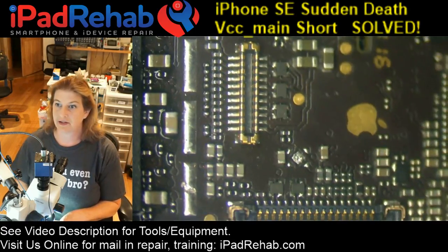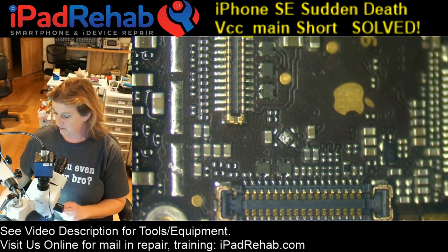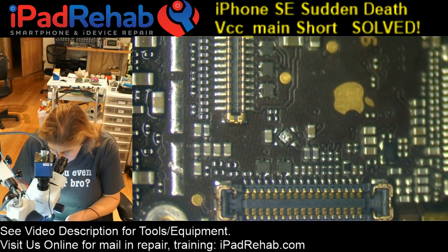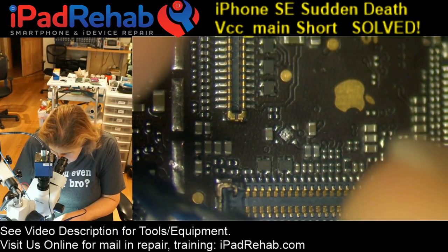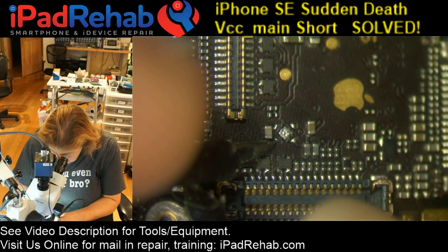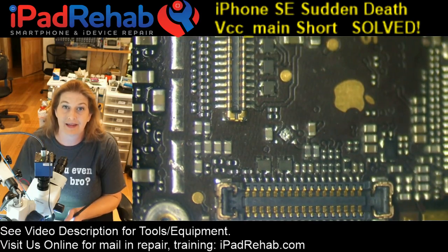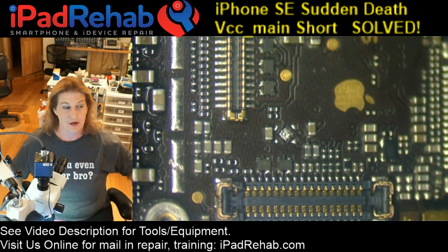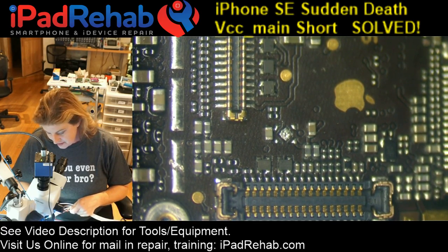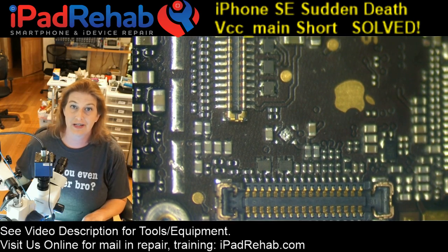Let's find a good VCC main spot. Maybe this cap here on the top of the board, and in diode mode, I'm going to stick my red probe on ground, and let's see what the current VCC main reading is. Right now, it is 0.001, so that is a full short on VCC main, which means that if I connect it to a DC power supply, it's going to suck a whole lot of current straight into the ground.